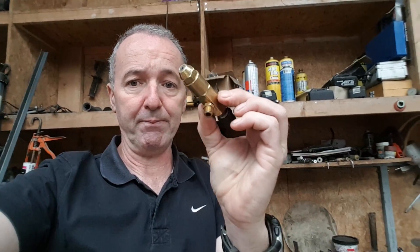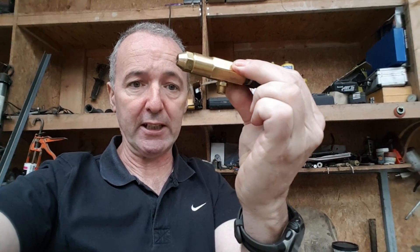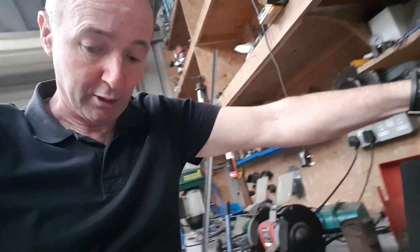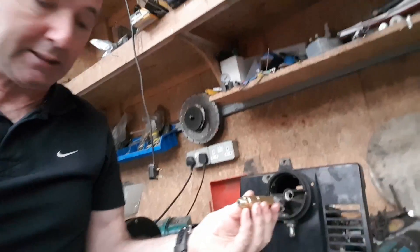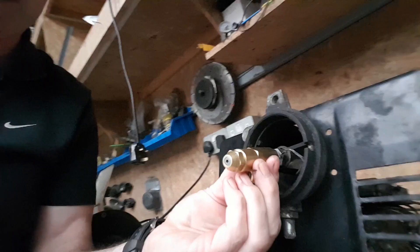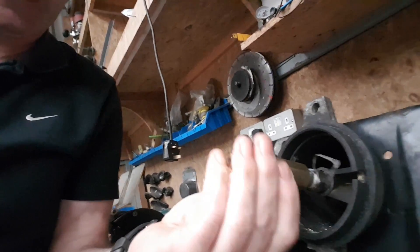Just a quick update. This is a siphon nozzle — it gets the air line in through the back and the oil feed in through the bottom of it. What I'm going to do is convert this Riello burner, but I can't do it today because I can't get the bits. Essentially, that goes in here, and it's going to get its oil line on a 90-degree bend.